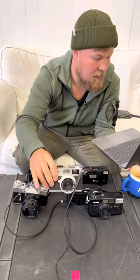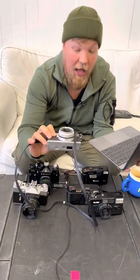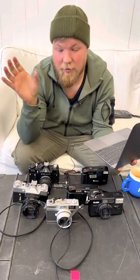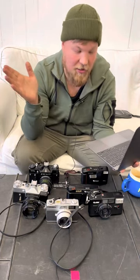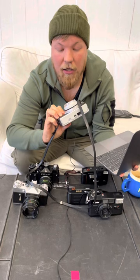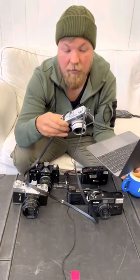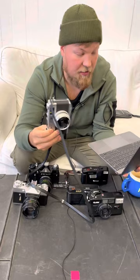And the interesting one: the Canon E28. It needs new light seals — I knew that. The meter reacts and works. It exposes correctly. With Canons it's always a question of whether the meter is correct but the auto exposure is still wrong — Canons do that for some reason — but this one passes both. It still has the front element fingerprint that didn't come off all the way, and there's a lot of corrosion on the top. But it's usable.